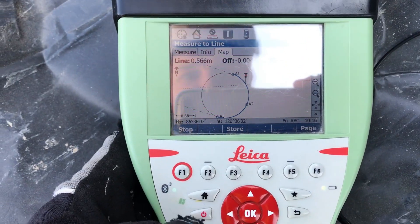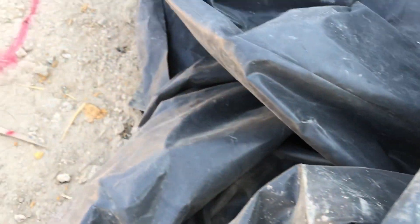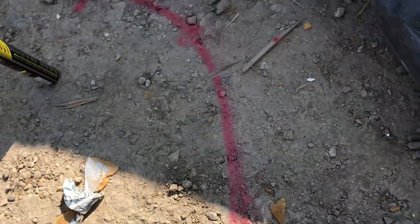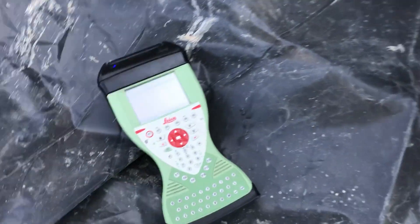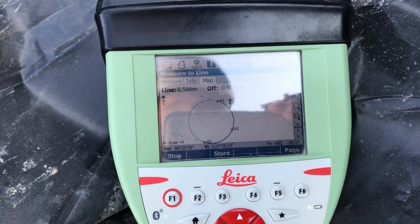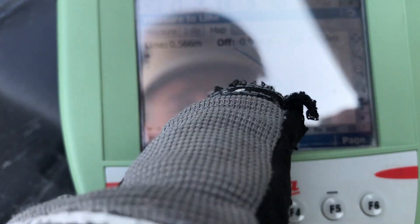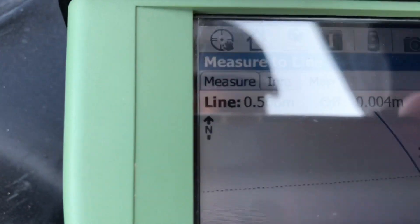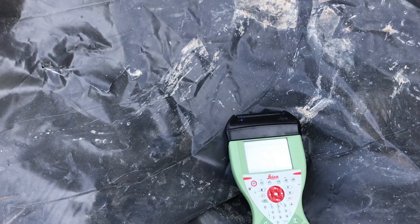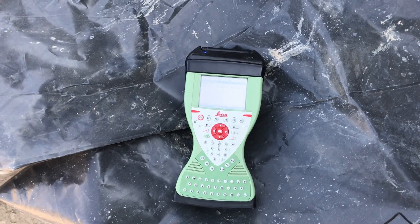With the robotic you can't really go wrong, as you've got everything on the screen. You can see I've got an offset of four millimeters, and you can see the arc. I'm measuring another point — that's the laser — and I've got just a few points to do this arc. I created the arc using three points. With the robotic you can even zoom in if you're not exactly sure about your offset, plus or minus, to check which side of the line you're on. Check my reference line video where I explain what it means to be on the left or right hand side of the line, and how the offset and reference line work.